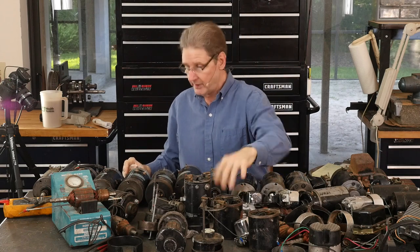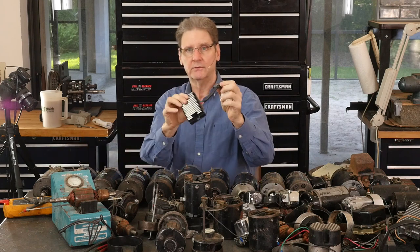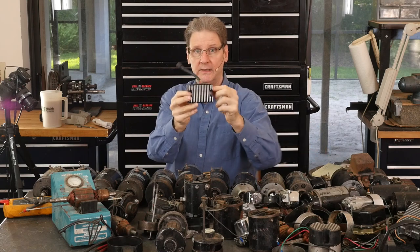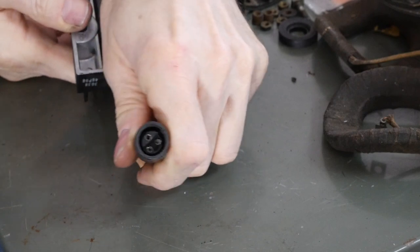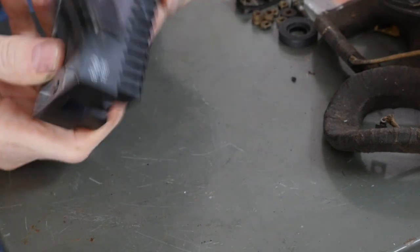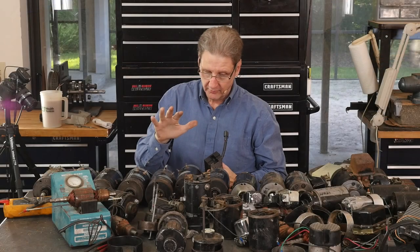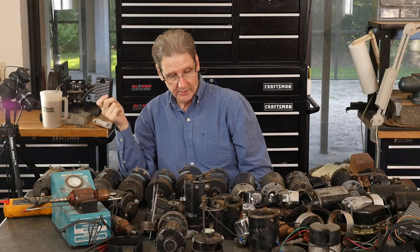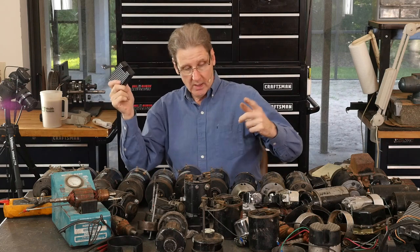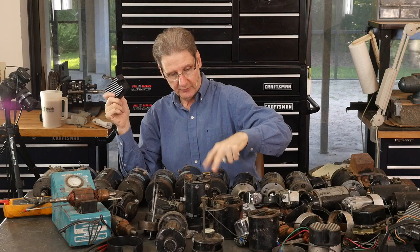So that regulator, then by the time they went to this, they had an electronic. Here's, you know, it looks like the aftermarket. I'll show you the aftermarket. Here's the electronics, the classic. So this is, I'm almost sure, a factory unit meant for these regulators. There was an electronic unit, I think 1 year only. I made a bunch of notes in the article, I'll kind of spell it out. Looks like 1 year only for the 65A generator, the one before this.